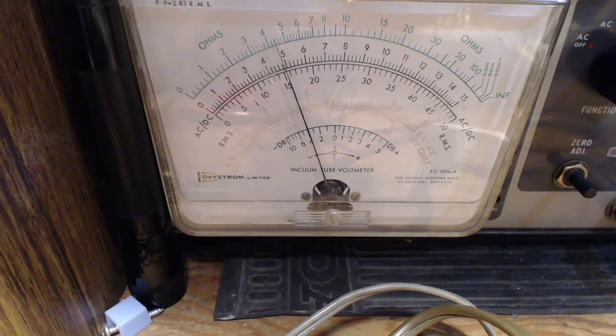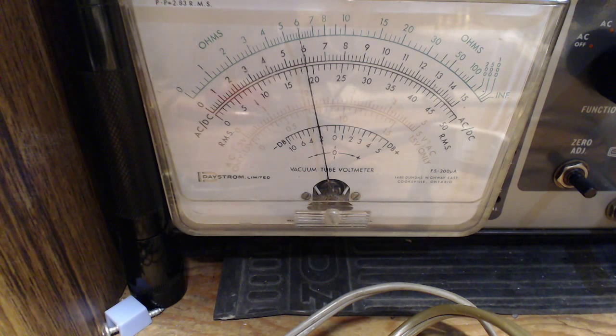Now we'll switch to the first IF transformer. First trimmer. That one was already maxed. Shouldn't have been. They should have all been tuned a little off to 455. I shouldn't be finding any of these right on. Here we go, the last trimmer here. Out of that one. Not bad. Got a little bit out of it.